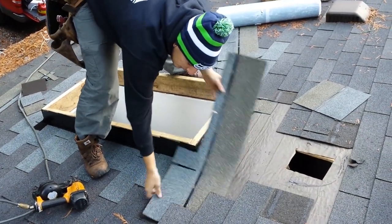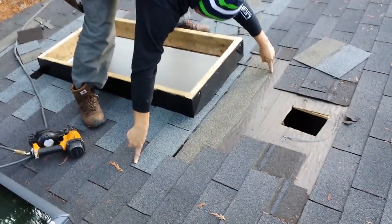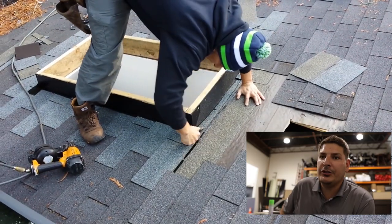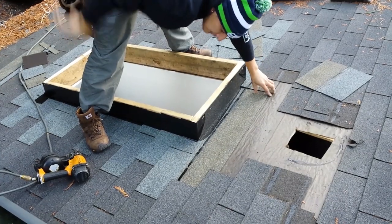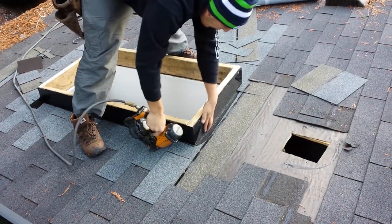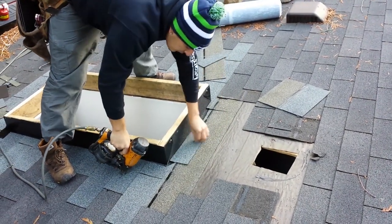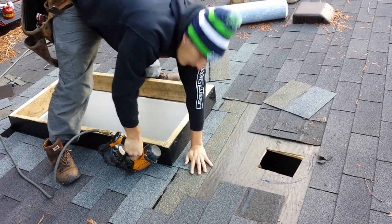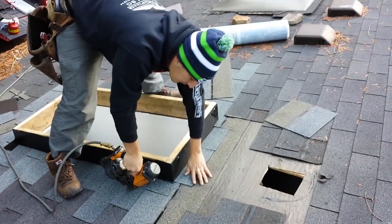There was a staple under there. Make sure all your staples are out. You can kind of feel them. So line up your top now. See, I don't have enough. Line up your corners. So boom. That's good. That's fine. We just want to throw in a couple here for it. That way it kind of keeps it up, the water will run around it. We don't want the water ponding right here.